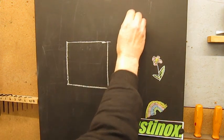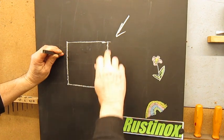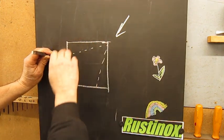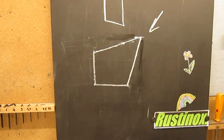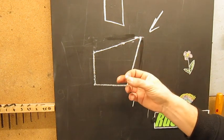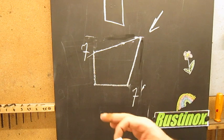And here it is. This point will be the cutting side, so we're gonna make a relief angle. This triangle is gonna disappear. This will be the cutting side for the other way too, so we take this away — and this will be the relief angle. In your book, if you have one — I don't have one — this angle should be about 7 degrees. We're gonna use a tool in both directions, so this angle will also be 7 degrees. Some other books say 8 degrees. We're not gonna argue with this.